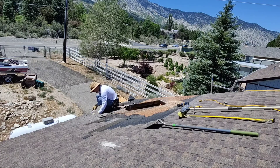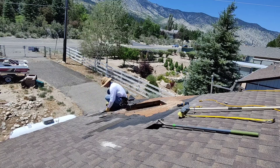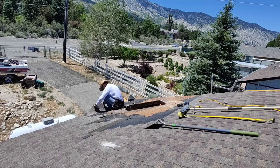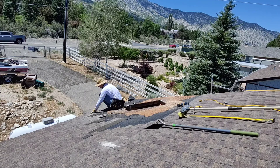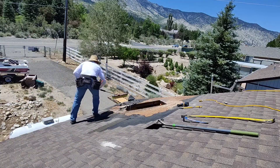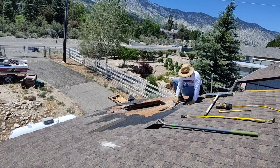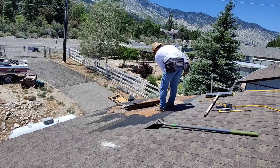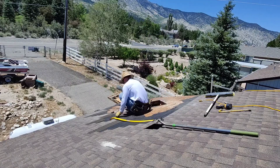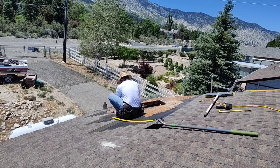Here you see me just tearing off the shingles. First I used a shovel to get the bigger parts off, but I want to remove as little of our roofing as possible so that I can tie into it. When you take strips of shingles off you always have to remove a bunch of nails. I also didn't want to leave any old staples or nails in place because that's just going to give you lumps and bumps under your new shingles. So I wanted this as clean as I can, and then eventually you'll see me tearing some of the plywood off.